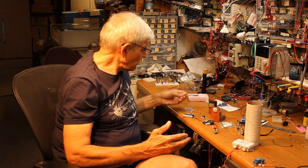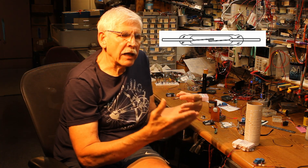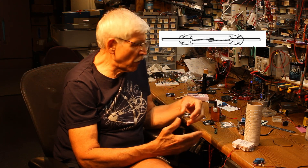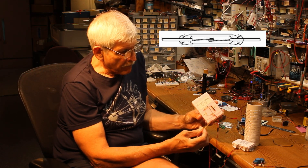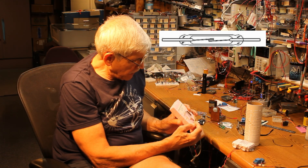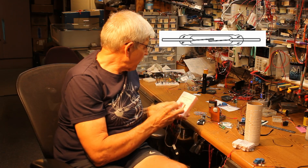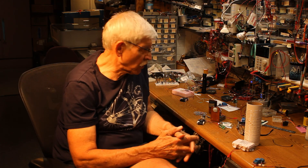Probably the simplest is to take a reed switch. This is a miniature switch that has two magnetic reeds in it. As a magnet goes by, those reeds come together, close the circuit, and when the magnet is removed, they open back up again. I've got a couple of reed switches here and an LED. When I bring a magnet near the reed switch, you can see that blue LED lighting up — and when it's removed, it goes out. The problem with the reed switch is that it's only going to operate when the train goes by, not when a person goes by, and you have to put a magnet on the train and a reed switch under the track.